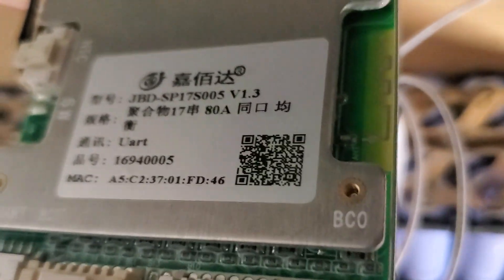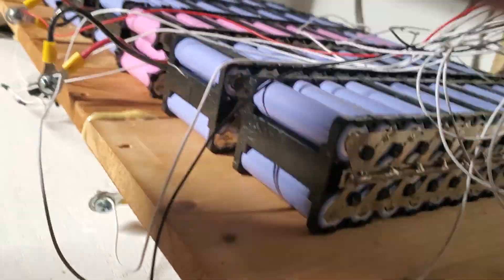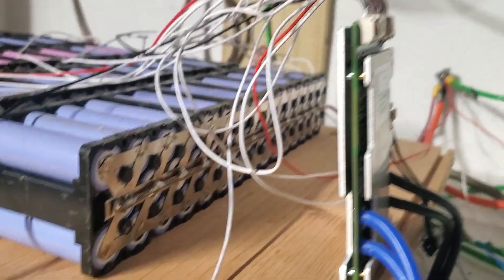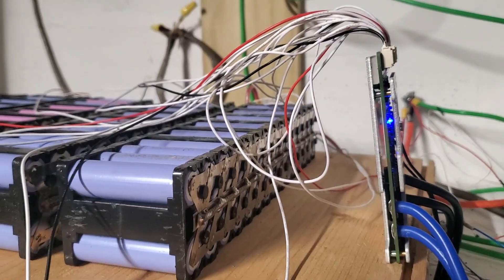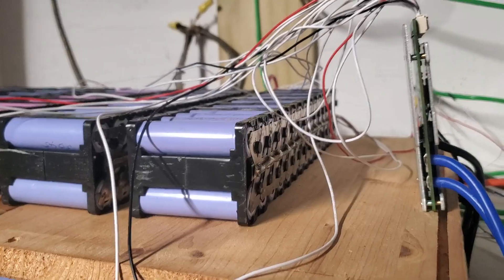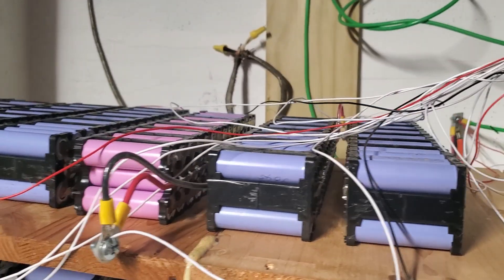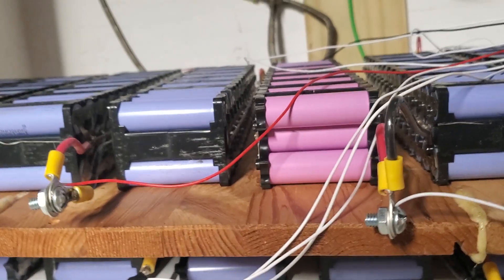This BMS is not that great but it does the work. The problem is you have to come in and unplug it sometimes when it refuses to connect. They have this thing inside — a dongle — and I can reach it from the house. But when it locks, I have to come back here, unplug and plug back in to regain access. You cannot try to change anything inside the BMS because it locks every time I do that.